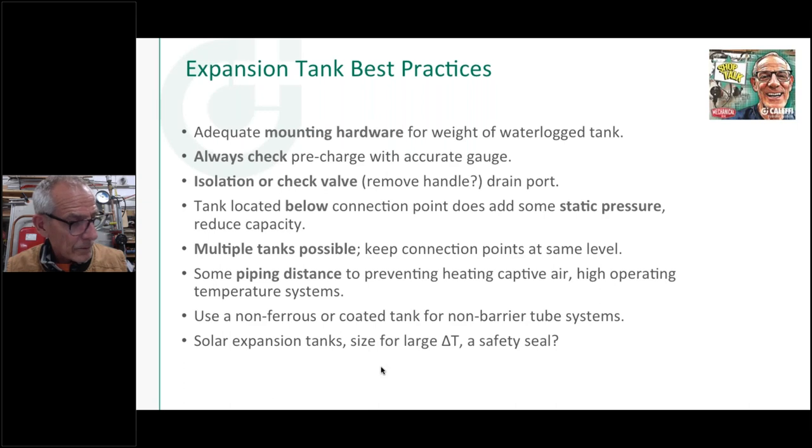And the manufacturer of the boiler, something about the placement of the expansion tank, you could blow off relief valves. Yeah, I mean, if you had too much pressure above the relief valve setting, you could do that. And I've seen that happen with high head circulators too. They have a static fill pressure of maybe 15, 18 pounds. They put a high head circulator on it. Now you're going over the 30 PSI.